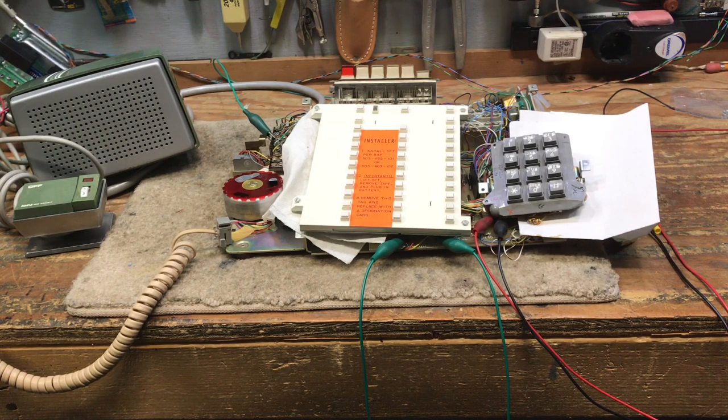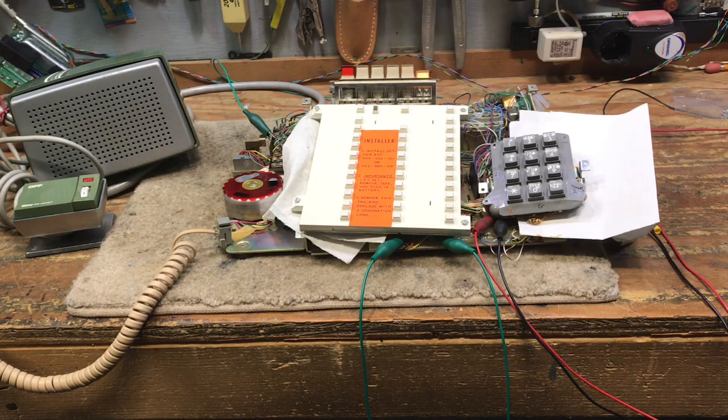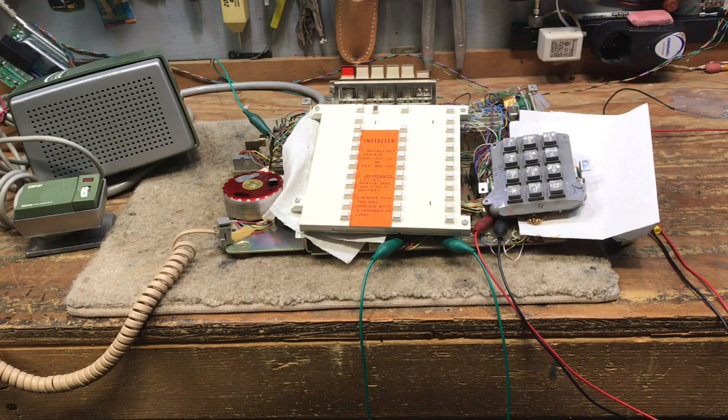With the line key selected, the speakerphone off, I will make a One Touch call. The dial tone detector in these phones will only detect the 350 Hertz tone, which is part of the precise dial tone, such as what we have today in the modern world, which is two tones mixed together. 350 and 440 creates the modern dial tone that we're familiar with.